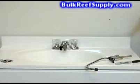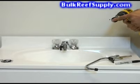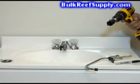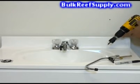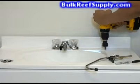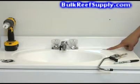Locate your drill and insert a 1-1/8 inch hole saw. Make sure it's a type with a drill bit in the center to stop it from wobbling around and scratching up your countertop. Locate the mark you made and simply drill the hole. Please make sure that the bit you're using is designed for the surface that you're trying to drill through. Once you've created your hole, we're going to go ahead and install the faucet.